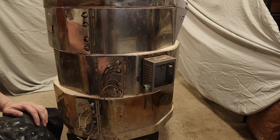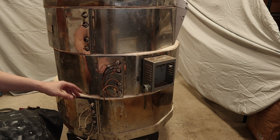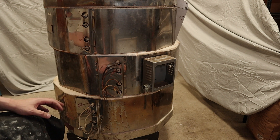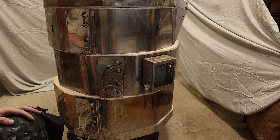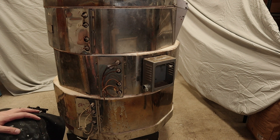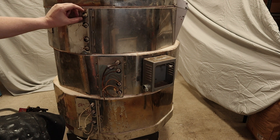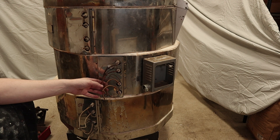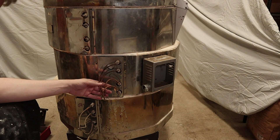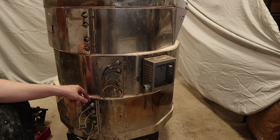I might need to take this box off to do that. All of the control panels in the middle that used to stack and plug together — I removed those. These all used to line up and plug into each other vertically, but those connectors are in bad shape. I'm glad I took that apart — there's definitely a problem there. The kiln would not have worked. The top section has screw terminals for the elements, which is great. These bottom two sections have really nasty wires. I think the bottom ones are probably okay — I might leave those rather than messing with them.